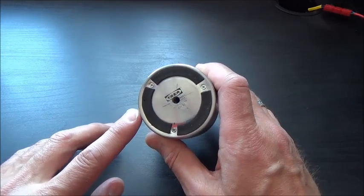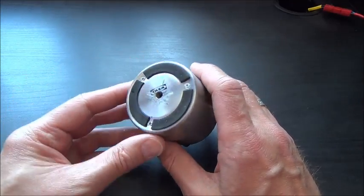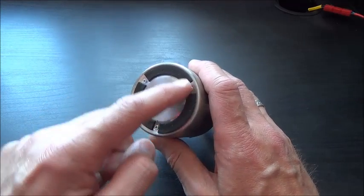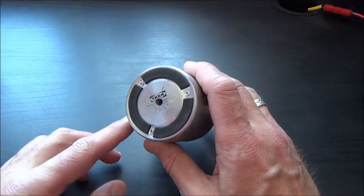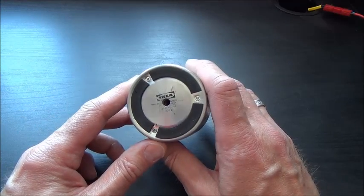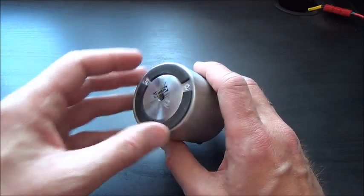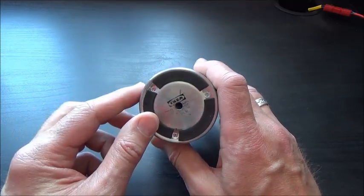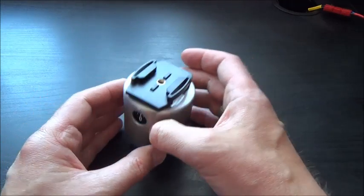You then pop a hole through the metal housing, which is really easy to center — when you look closely there are rings on the metal where it's been machined, so you can see exactly where the center is. Drill the hole the right size for the bolt on your camera tripod, fit the housing back over the top, put the three screws back in, and that hole should line up nicely with the nut sunk into the plastic part of the egg timer.